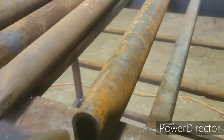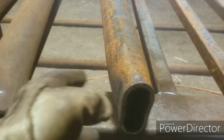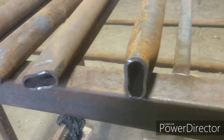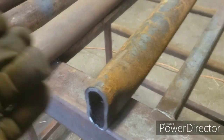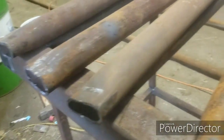So anyways, cutting these pipe, drawing it with my jig there for the plasma cutter, would take me about 2.5 hours to get to this point. That's cutting all the pipe and getting them all saddle cut, all for doing a portable panel. I had all this cut in less than an hour and squashed. So, time savings?